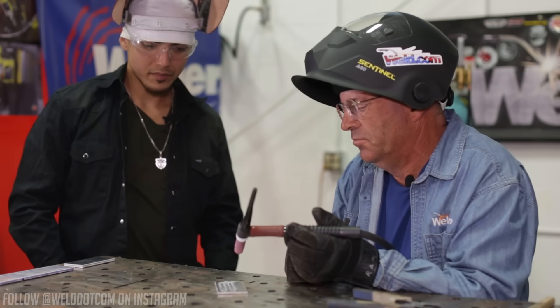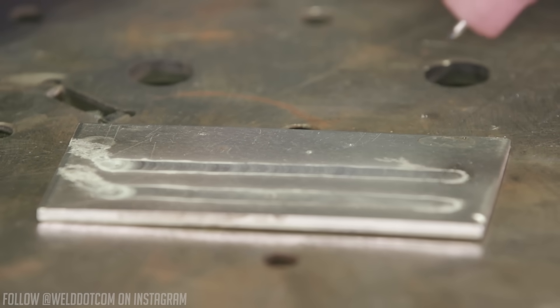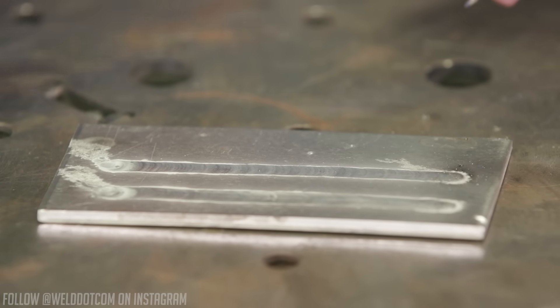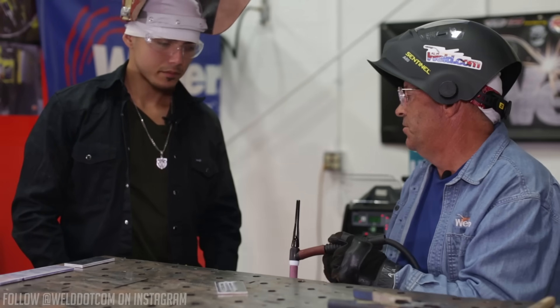It's quick, it's fast, but look at the edge of the bead - you don't see that haze around it. It's concentrated now. You can see what you can do in one of those fillet welds - it's driving the arc in there tight.